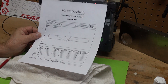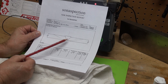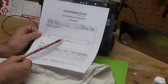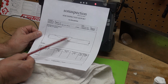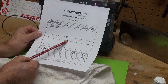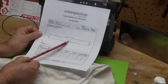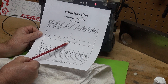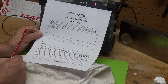Let's take a look at a lack of root penetration. This is my weld right here at two plates that are 0.625 inches thick. When the welder made their root pass — the very first pass to join these two pieces of steel — they did not get good penetration at the root. The weld metal should completely join this machine surface, and we should have a slight root protruding, but in this case it was a lack of root penetration.